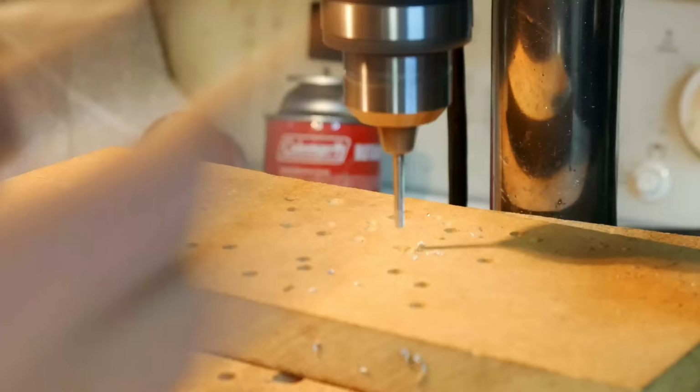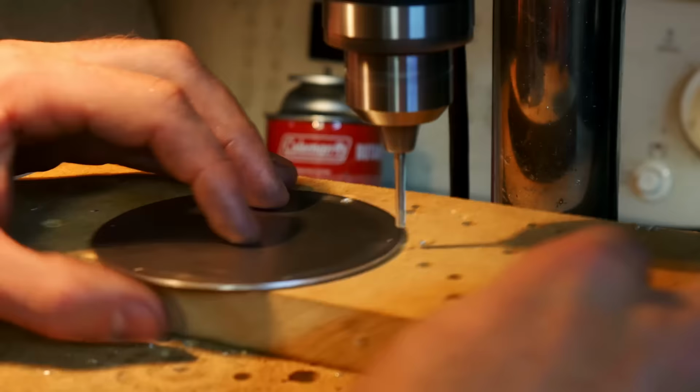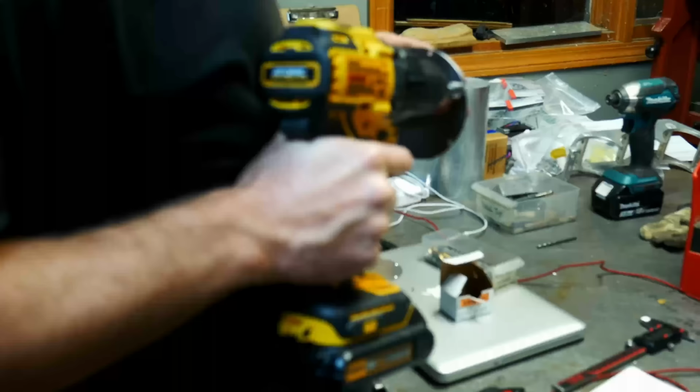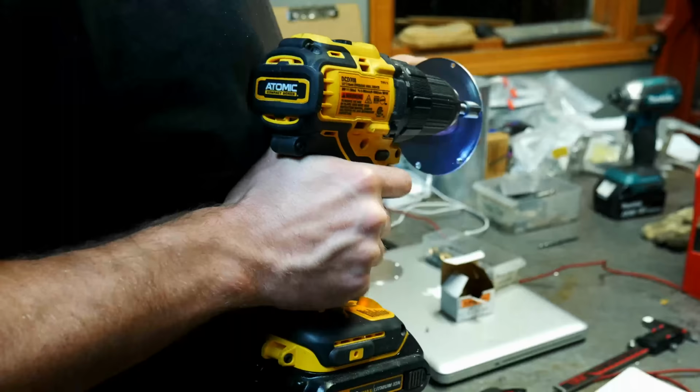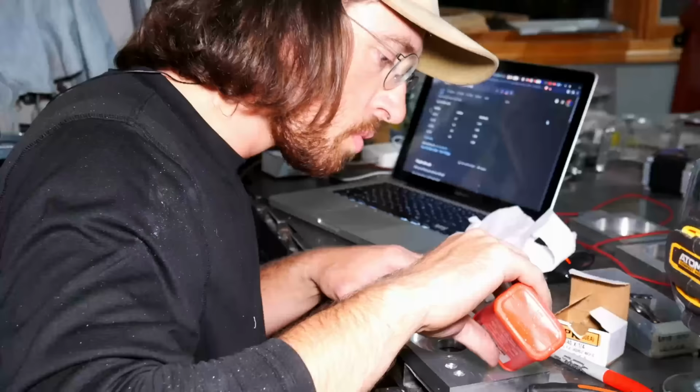And like I said, I had spotted those on the machine and now I'm just drilling them out by hand. These are smaller than 1/8-inch bits because they're for 4-40s. I'm just doing the countersinks by hand because these are countersunk bolts and because of how small they are. And I'm starting some tapping.